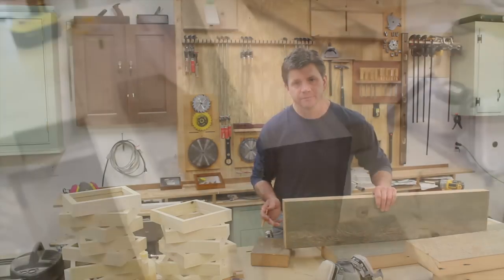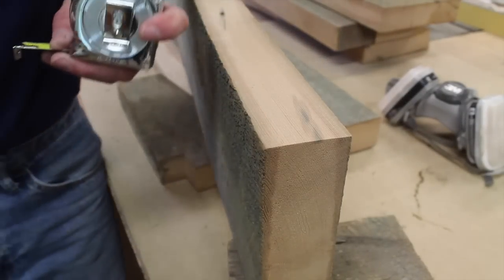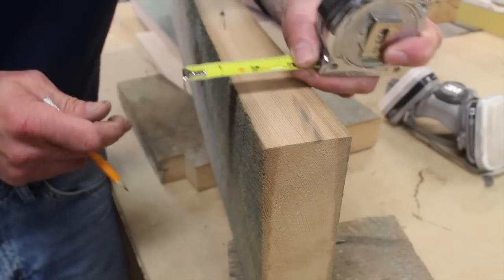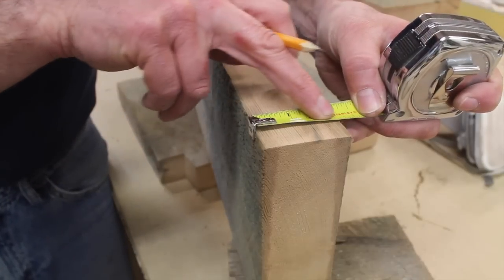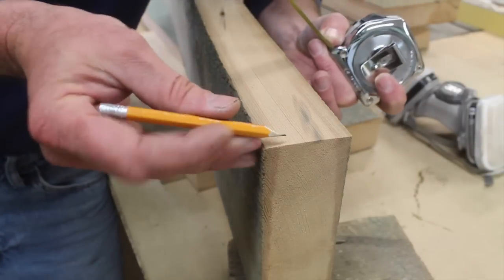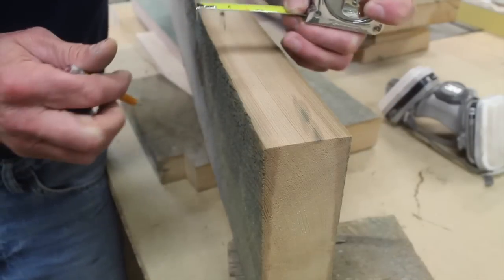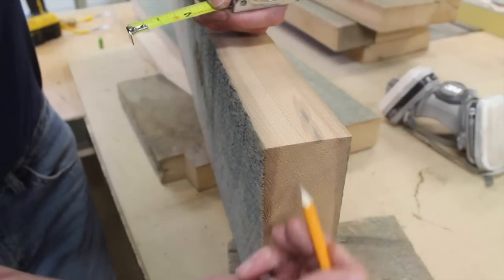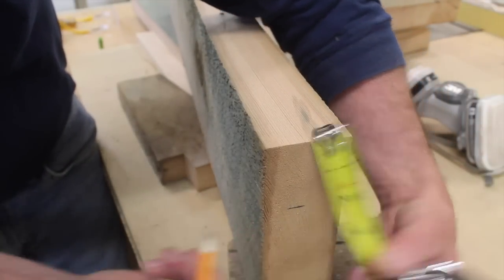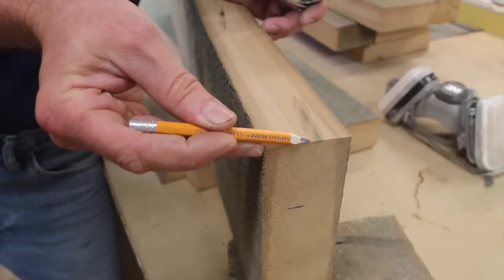I'm going to bring the camera over and show you the grain of the board, then we can get started. I should add that I pre-milled these boards with my circular saw, with the idea that if I hit a nail, I hit it with the circular saw and not my table saw or my jointer. You can see the board is just about two inches wide with a really nice straight grain — that's what I want on the face of the frame. What I'm going to do is first rip the boards at two inches, right about here, and then re-saw the boards in the center.